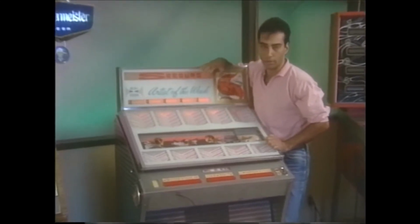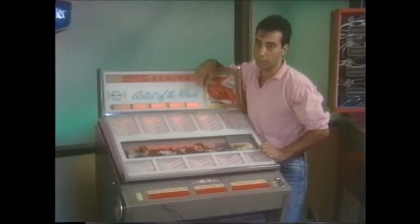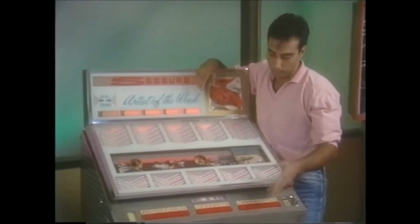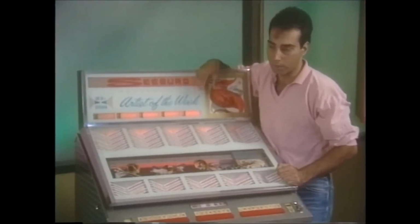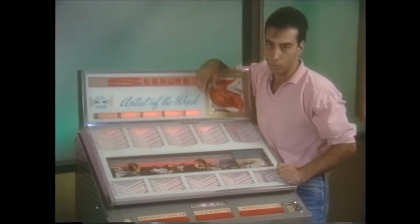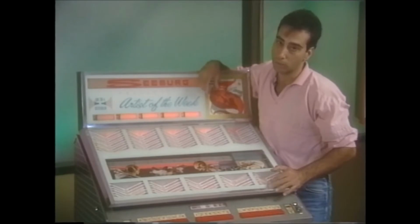They use an all-electronic selector, which is the Tormat, and it's a little bit of a project if you have to get in it and repair it. They go into what I call Seeburg dumb mode. You make a selection, they go back and forth, won't find the record. Could be anything. And you have to have a service manual to troubleshoot this.